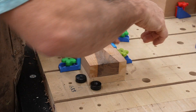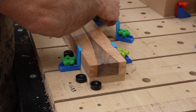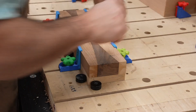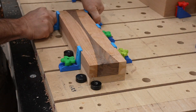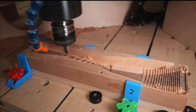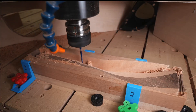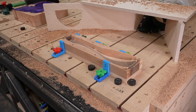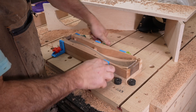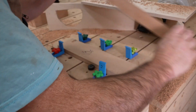I'm using 3D printed toe clamps that I designed with removable tips — these are two-inch tips which work great to hold the stock down really well. The origin for the top operation doesn't have to be very precise; you can roughly align it by eye, because you're going to be drilling alignment holes that will precisely locate it for the bottom operation. I've been doing pretty shallow passes with a quarter-inch upcut bit, and I think I could do more aggressive machining, but this avoids a lot of chip out. The finishing operation was done with an eighth-inch ball nose, and I like to go perpendicular passes to the grain — I think it gives less chip out.